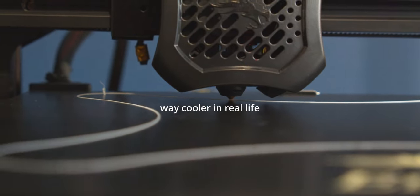When it comes to the inside of your model, you have an option of how filled in you want it to be — very hollow or completely solid. The amount of infill inside the model you choose will use more filament. If you want it to be tough and you set it to 100%, it's going to chew through that roll of filament and cost you a lot more money, but it will obviously provide more rigidity and strength.